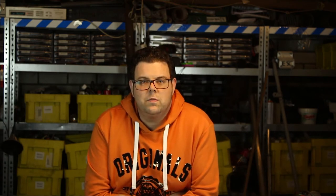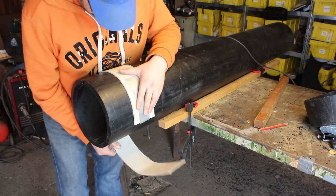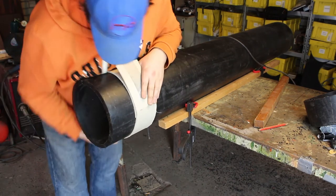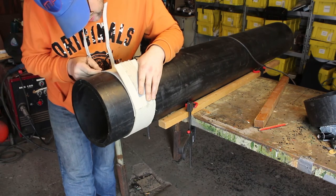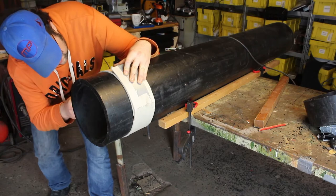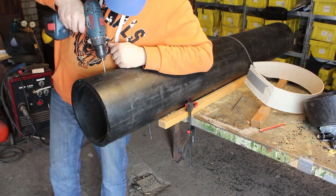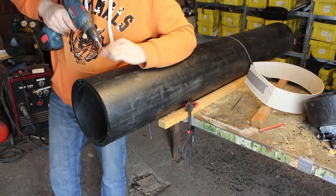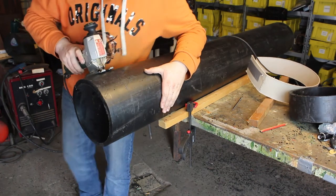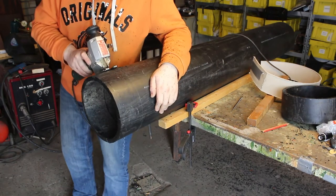The first thing I did was cut the HDPE tubing. It's important you mark it really clearly. If you use a piece of cardboard that's straight on one edge and wrap it all the way around your tube, it will fit tightly and then you know you have a straight line. Mark it, then drill small holes next to each other for the electric saw to start cutting. Make sure the piece of HDPE tubing is clamped good and tight on the workbench and cut it all the way around.